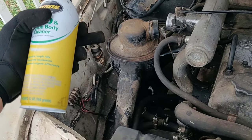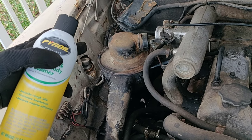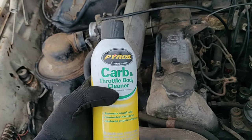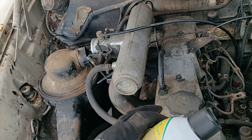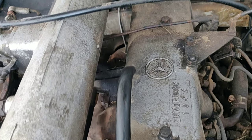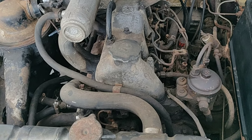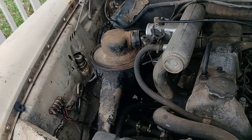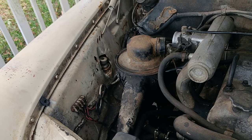We're going to clean out the old oil — we don't have any in there right now — but we're going to wipe the whole system out. I'm also going to be sanding down and painting this before putting it back in using a high-temperature paint. I wanted to show you something quick: I tried engine degreaser and Simple Green, and nothing was really getting it back to color. But I just sprayed some carb cleaner here, wiped it, and you can see how well it cleaned it. Carb cleaner might be the best for cleaning oxidized, dirty parts in here. So let's clean the mesh filter, let it dry, then prep and paint the oil box.